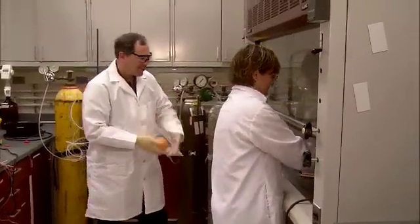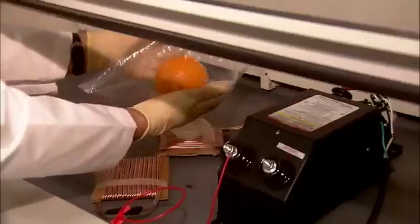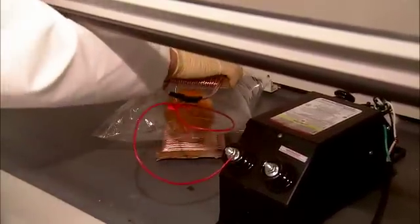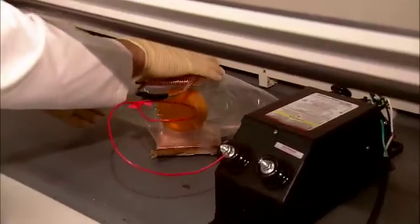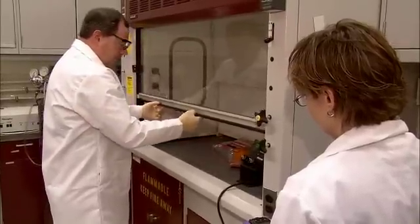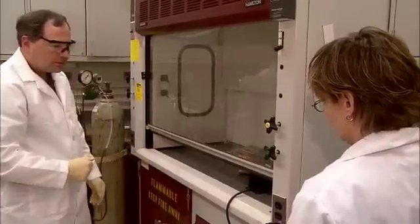What type of method actually keeps the fruits and vegetables sterile? Well, this process — what we're able to do is, in the package, we can actually generate what's called ozone. We take oxygen that's in the air naturally, we apply a high voltage to that oxygen, and those oxygen molecules then recombine into this ozone molecule, which is a bacteria-fighting molecule that we can generate in high levels inside of the package.